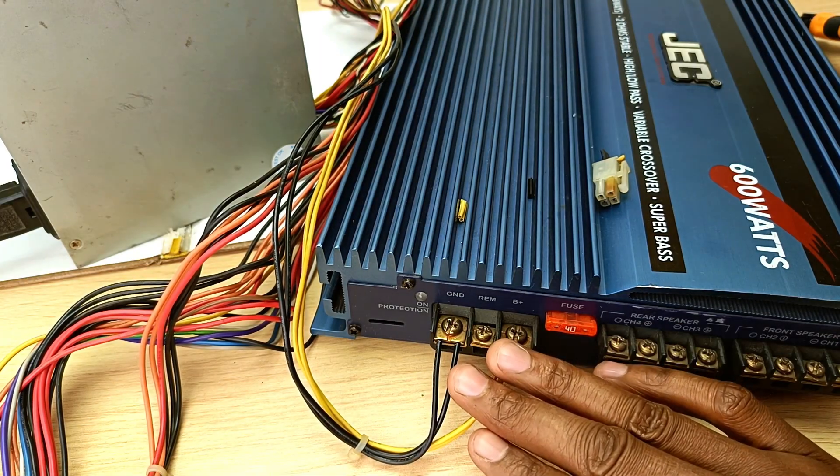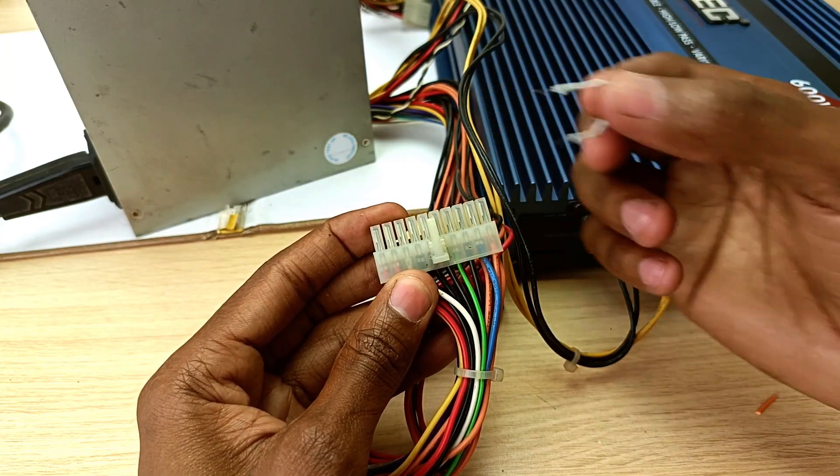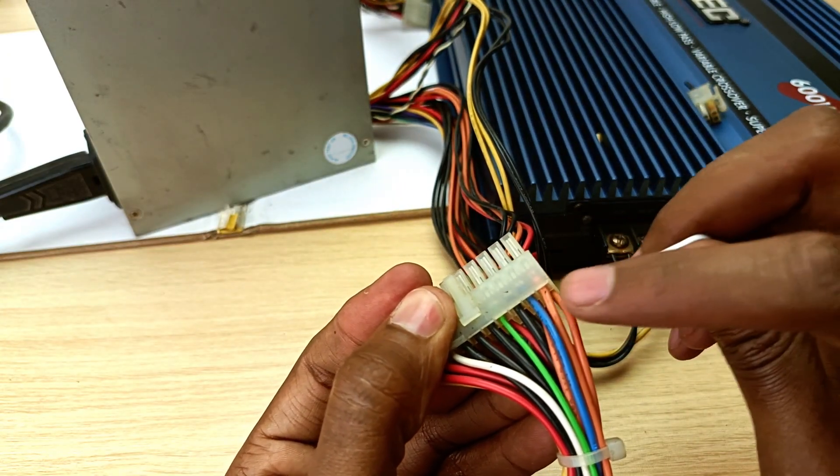After this, we need to figure out how to turn on the power supply unit. To turn on the PSU, we need a short piece of wire and we need to connect the green wire to any black wire. The green wire is usually the fourth cable if you count — one, two, three, four. I need to connect that green wire to any black wire.